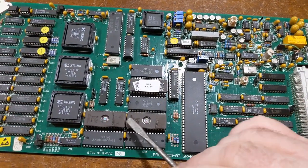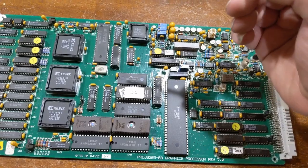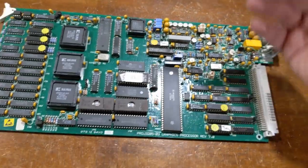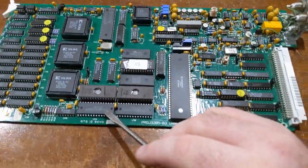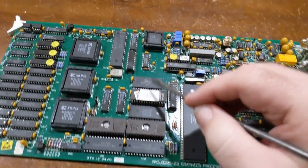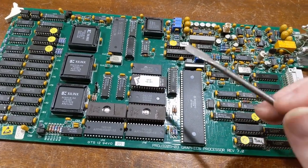Again, we have a couple of system ROMs here that are just bootloaders. So when the program is running on the CPU, it can send an interrupt back to this card. Then this card realizes it's ready, and then it executes the bootloader and starts downloading its program into the memory, because the program is not on this card. Again, it's got to be downloaded into the memory. So these are the two SRAMs for this chip here. And this is the SRAM specifically for the 8031, which is the MCS51 series.